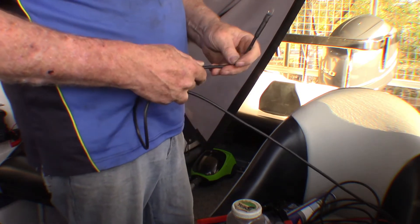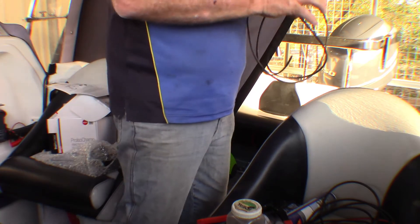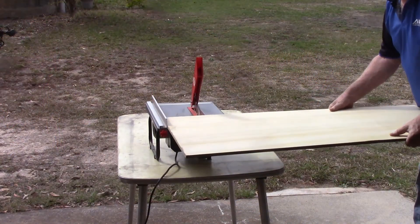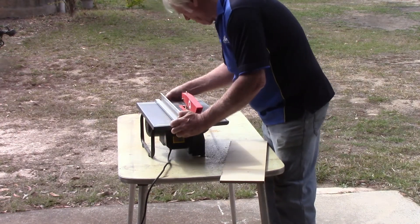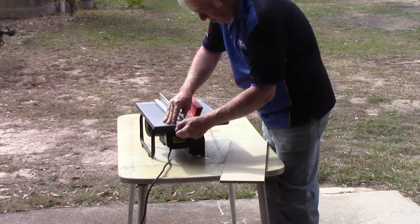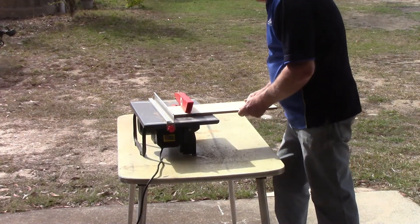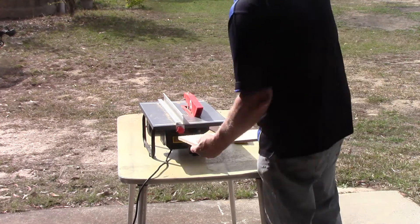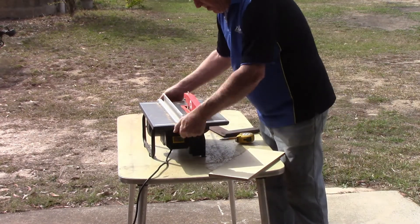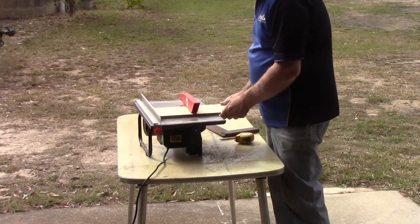Before I do the other end I'm going to measure how much I need, because I want enough slack to be able to slide the batteries out but I don't want so much that it's just wasted wire laying around the boat carrying high amperage. Here I am cutting up some marine ply to make brackets. I don't want to drill any holes through the boat if I can help it, so I'm cutting these brackets out of marine ply. I'm going to varnish it so it endures the elements, and I'm going to use some existing bolt holes where the original isolator switch is mounted. On the other side I'll just glue the marine ply to the inside of the boat and screw into that so there are no holes through the fibreglass.